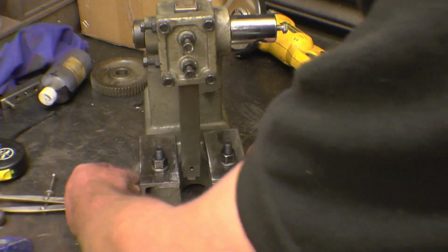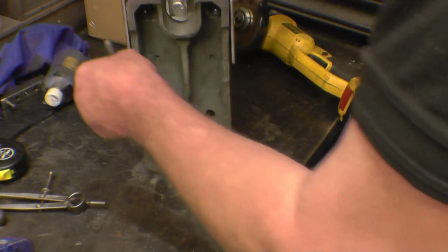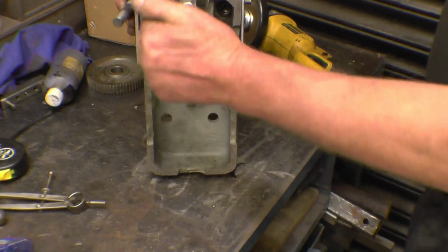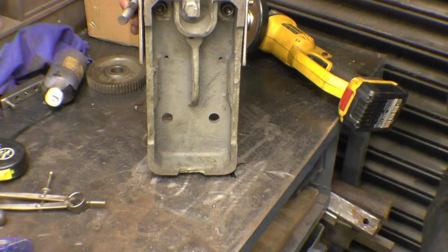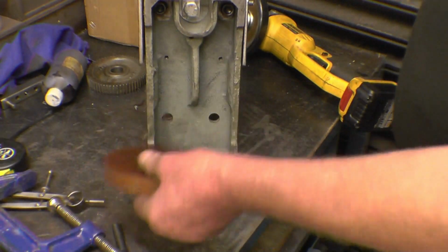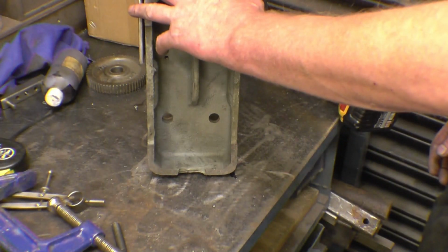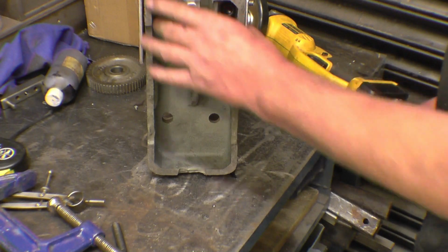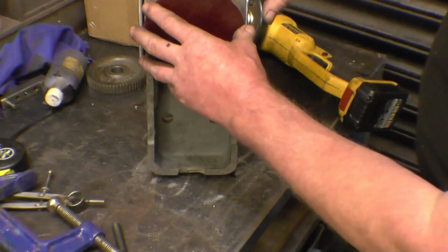So now I want two lugs on there, so I can put these studs down through it, make a plate for the bottom. The plate will be clamped up against parallels, so nothing will move around. It'll be quite a sturdy job when I'm finished, and I'm only going to be broaching steel, but basically these gears are just tough little things. It just makes the press a lot more versatile. I had extended it, but the gap in there, the throat in there, wasn't big enough. But obviously the distance I've got between those two, I can definitely get that in.